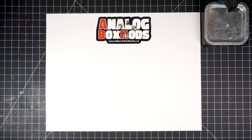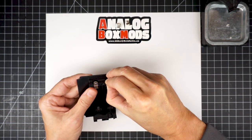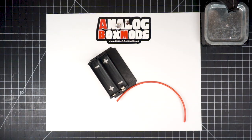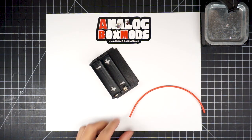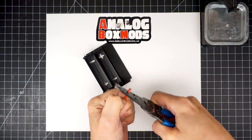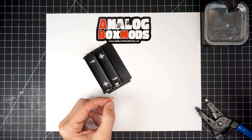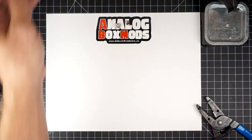And we'll get these onto the sled so I can measure the length for the wire that'll bridge the top of the sled. Now I'll strip the whole piece of wire here. That insulation is a few millimeters thick, and it pushes the exposed part of the wire away from the contacts and makes it harder to solder. So I'll tin half, strip the remainder of that insulation, and then tin the whole wire. This way it could sit flush on the contacts.